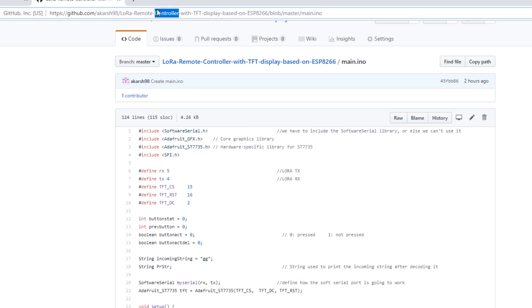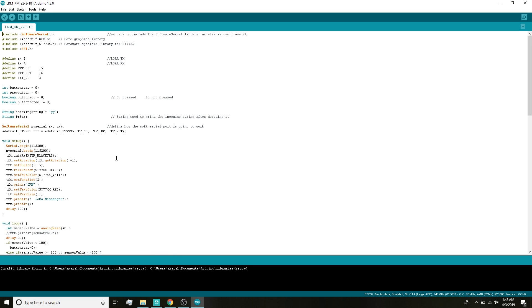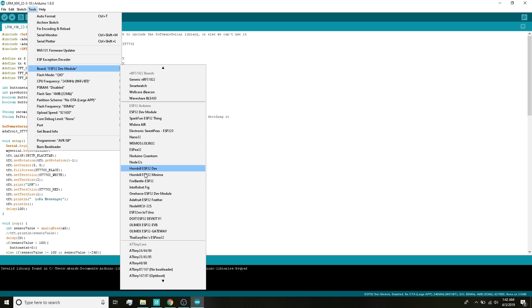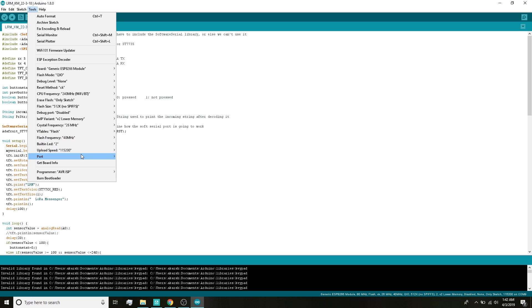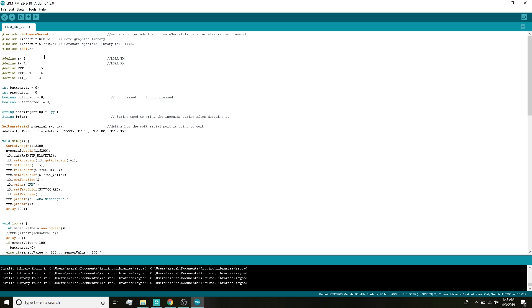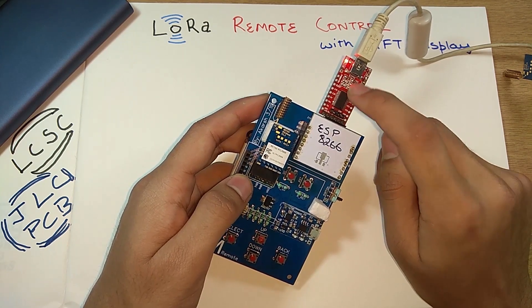The code is uploaded on GitHub — I'll provide the link in the description. Copy the main.ino into the Arduino IDE. Connect your FTDI board to your laptop, go to Tools, select the ESP8266 module, then select the correct COM port — COM12 in my case. After adding the required libraries and code, hit the upload button, remembering to follow the GPIO0 and reset button procedure first. Once compiled and uploaded, we'll get back to the table.